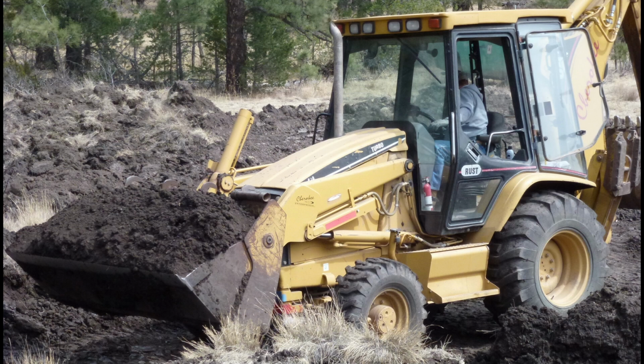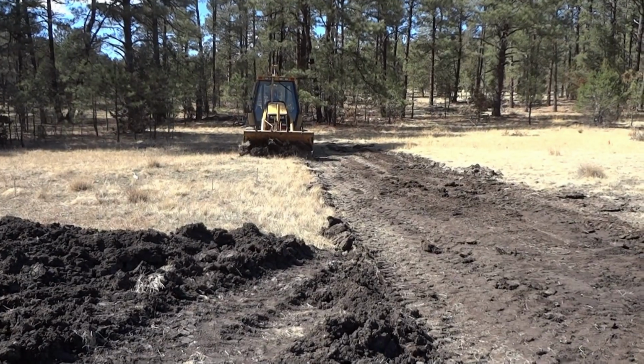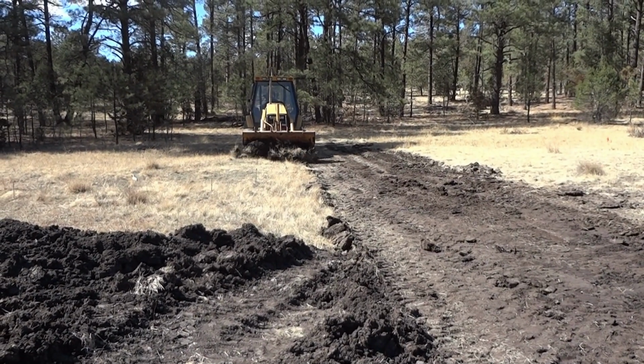The Forest Service contracted with a local business to provide a backhoe with an operator and a dozer with an operator to complete the project. Since this project was completed, I now recommend using an excavator and a dozer and a vibratory roller to complete similar projects in the future. The backhoe begins work by removing the topsoil within and surrounding the constructed ponds.